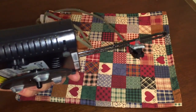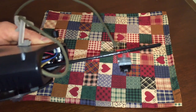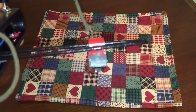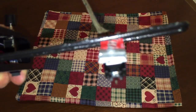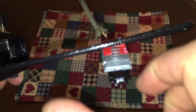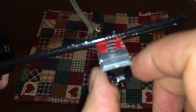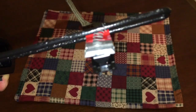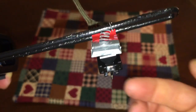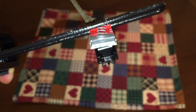I hope you enjoy this invention. I spent a lot of time trying to make this work — it's taken a lot of engineering on my part. There is one difficulty with it: the spring that you see here by my finger is needed to push the needle onto the record, but it has a tendency to get stuck on this bar. So it'll play for a little bit and then start skipping, and as you can see, the spring almost grabs onto that bar it's hanging on to. It's unfortunate, but I really don't want to spend any more time on it. The concept is here.